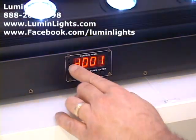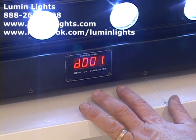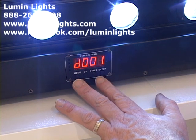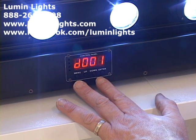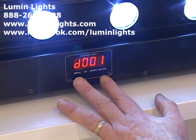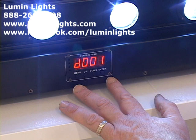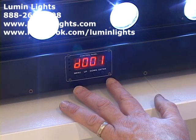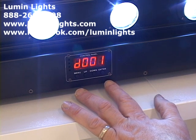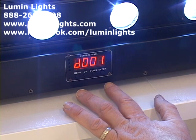After that menu, we cycle back to DMX 38-channel mode — that's how to operate the bar manually using the LCD push-button display. You can also hook this up to DMX and control it via 9-channel or 38-channel mode; refer to the manual and DMX chart for which channels control what. The last thing we're going to show is linking this bar to a secondary bar in master-slave mode.